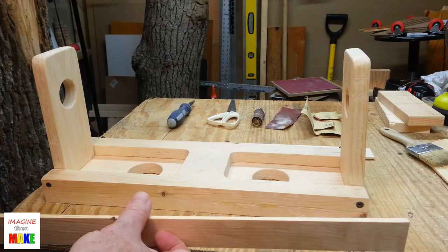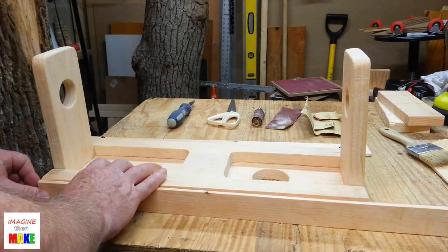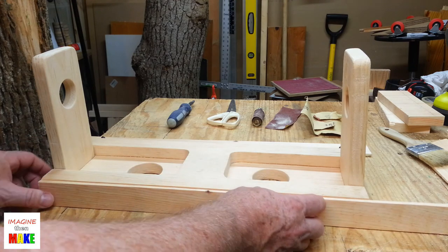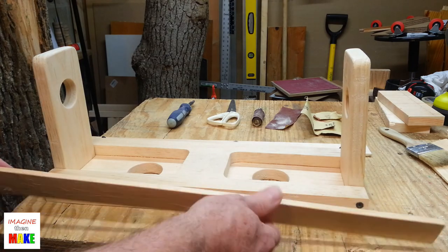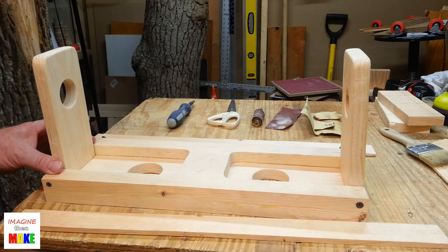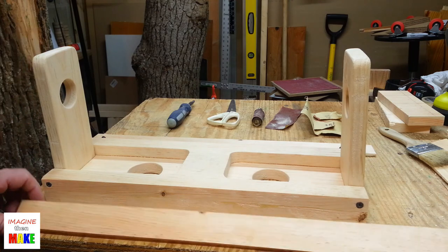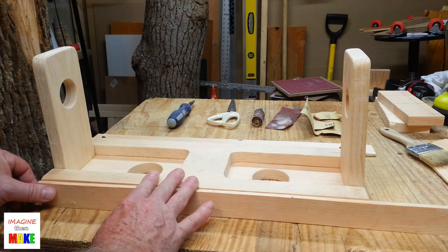And that leaves me with two strips that I can glue on the faces of the bookshelf. So what I have left to do is I'm going to do a little bit more planing to make the thickness uniform. Then cut this strip to length. Of course, this one and this one. Take the flaps off, and then apply a finish. And then once the finish is dry, reinstall the flaps, and then glue these pieces in place. And then it'll be done.